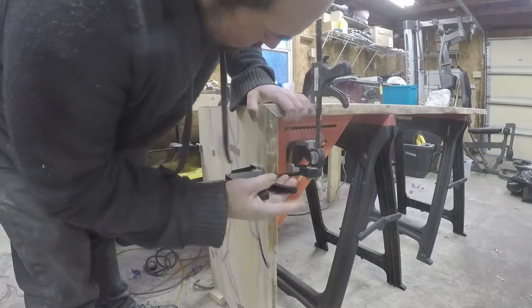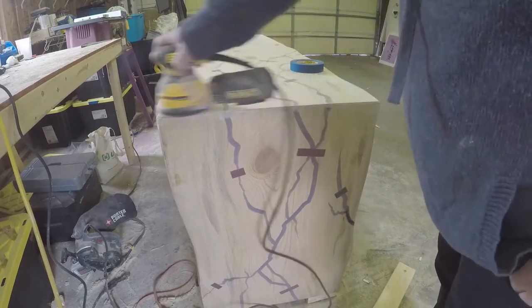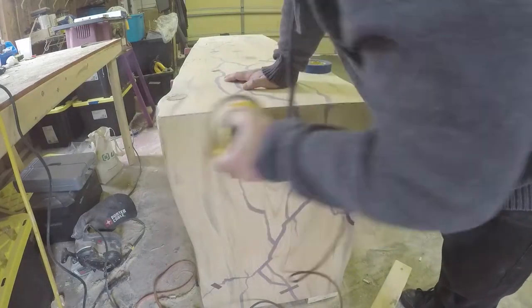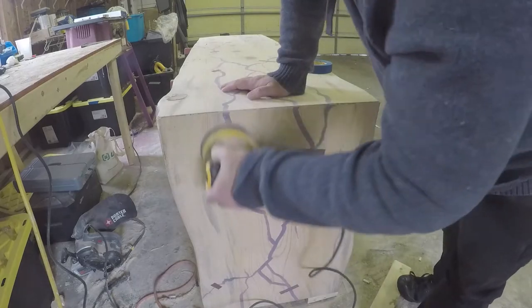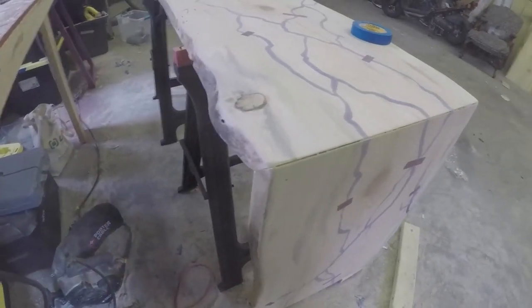One of the issues here is that I didn't have a perfect 45 degree cut. And so the joint opened up a little bit on me toward the outside, but I wasn't particularly worried about that because I had this idea to treat the joint in the wood where it waterfalls over the same way as the epoxy, and here you can see that joint opened up.